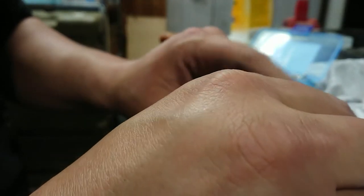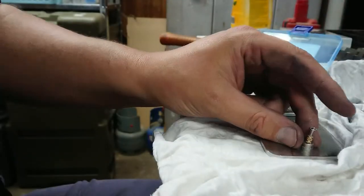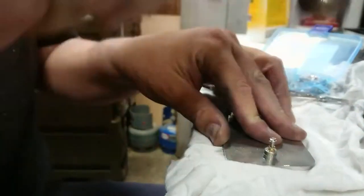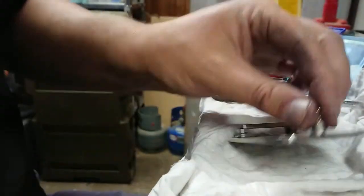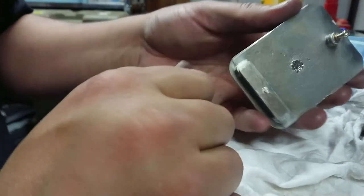So what I'm doing now is screwing my threaded inserts onto a screw, which I'm going to insert into this hole, and I'm going to hammer the inserts in. The hole is just a smidgen bigger than these threaded inserts. And I'm sorry you can't see me manipulating this, so tiny. But more importantly, that screw comes right out now. And then we'll put a nice little shorty in there, and that will create our little belt loop hook. And I'll grind off this other bit in a moment.